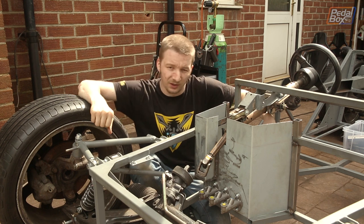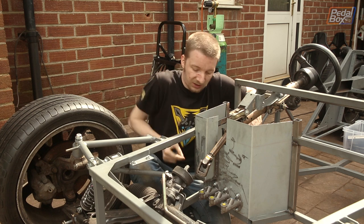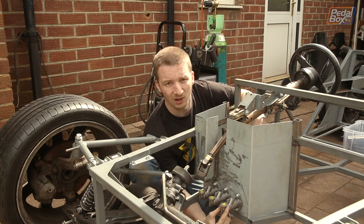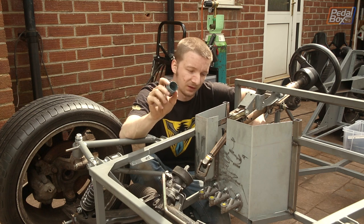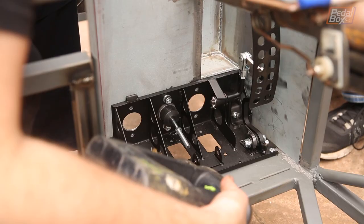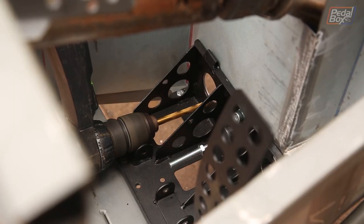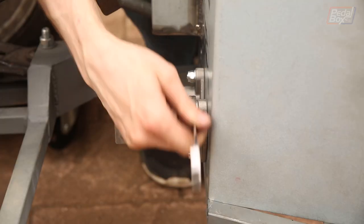It's looking pretty good. We still need to prime it, but we'll get to that later. We've been busy this morning getting the master cylinders themselves bolted up — we cut out a nice big 35mm hole for the hydraulic barrels to fit through, and from that referenced the main bolt holes that hold them in place. Now they hold the firewall onto the pedal box, the pedal box is bolted to the chassis, which means everything is now in place and we can start building the rest.